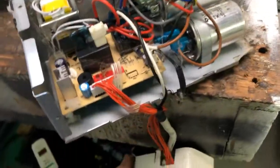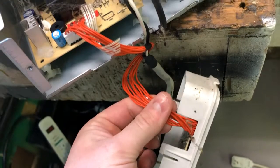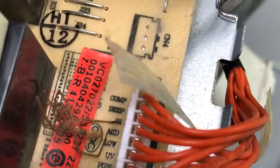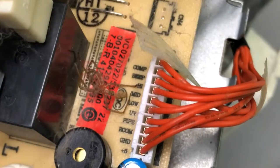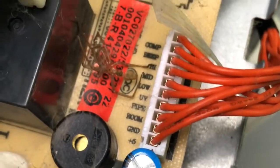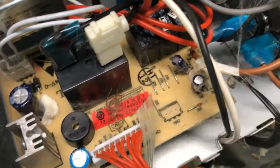Not knowing how I was going to integrate these, at first I saw this and thought it might work — maybe there's individual wires that just trigger the relays. And sure enough, we actually have a chart here that says what wire does what. So we've got 'comp' which is compressor, 'beep' which is the beeper, and then high, mid, low which I assume is fan speed, and we've got ground and plus 5 volts. 'Room' is presumably the temperature sensor. The other ones I'm not sure about — potentially things this model did not have. There's definitely some space here that could have been used for extra features.